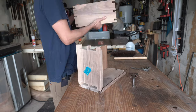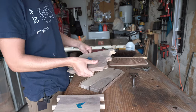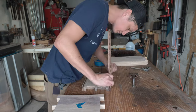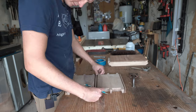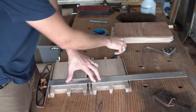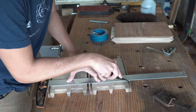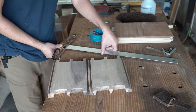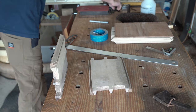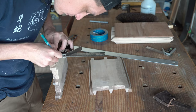So the triage here could have been done at least one other way that I can think of. I was worried that trying to mark tails on a fresh pin board with the miter cut already on the tail board was going to be an absolute nightmare. So rather than just cut an inch off straight up, I can sort of extend the pins downward, which should in theory be more consistent than starting over because I can follow what I've already established.